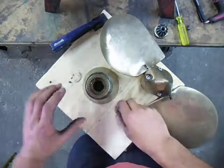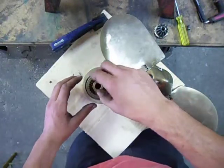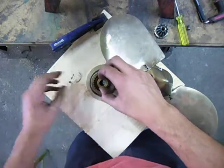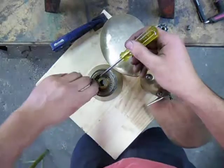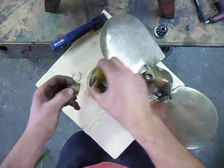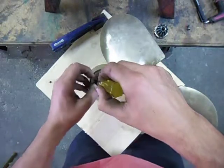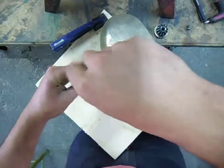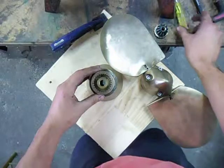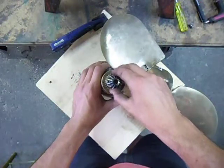To put it back together, you put the line cutter on the spline, any spacers that were on the spline go back on. The nut goes on and gets done up. Then, very important, the little cheese-headed screw goes back in. Then the pinion goes back in on the same setting that it came out — I'm just going to put it in on the datum, zero.